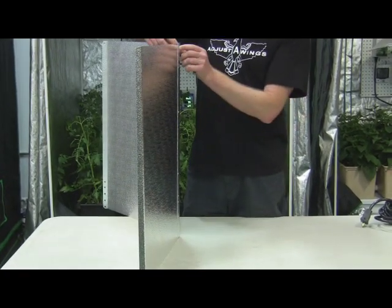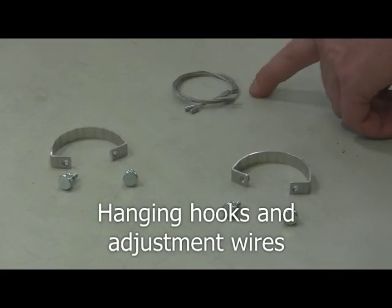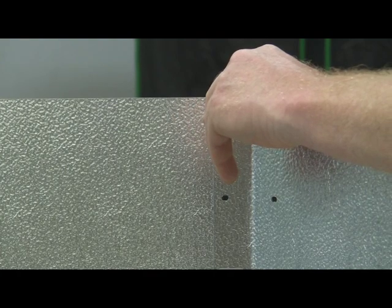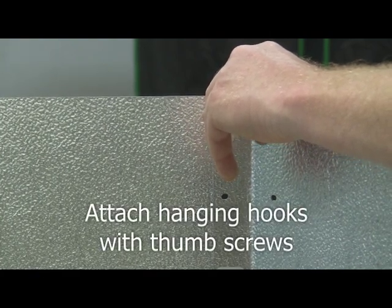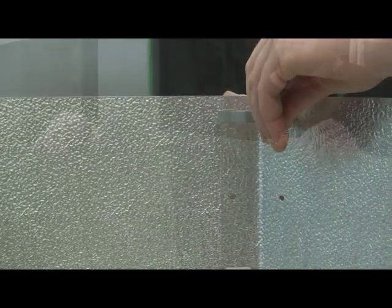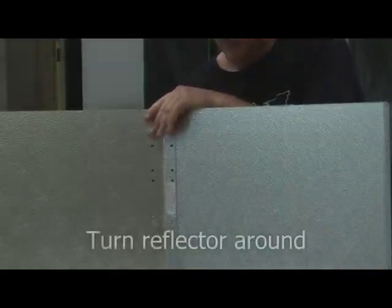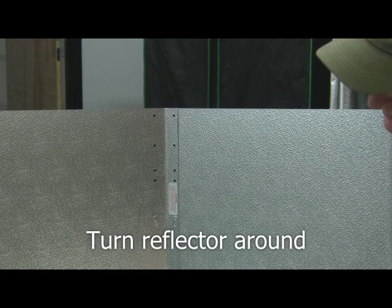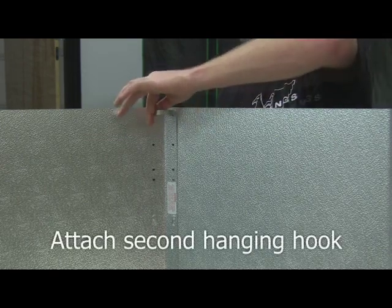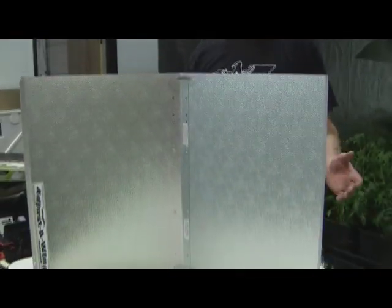Before we put anything else on the wings, we have to secure them together with the hanging hooks. These are the two hanging hooks that fasten the wings together and stop them from moving. And these are the adjustment wires that we use to create the double parabolic curve. The bolts go straight through and should marry up with the threaded inserts in the hanging hook. We'll just screw that on until it's just a bit more than finger tight. Now the reflector is rigid and secure, and it's ready to be flexed into a double parabolic shape.